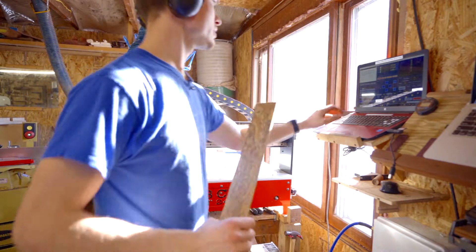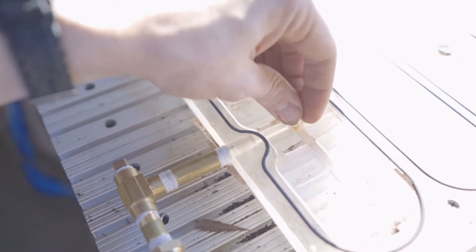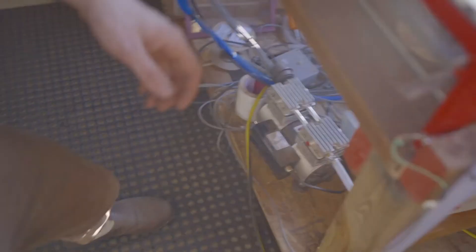I have the board cut, so I'm going to move this machine out of the way. Up here is the vacuum table — you can see this pipe coming in, that's where the vacuum gets pulled. We have this plug here that stops the vacuum from sucking up at the top. We'll put those in every single one except for the board we're running, which is this one right here. We're just going to put this seal over the top to seal it all off. Now the vacuum is only going to be pulling on this board. This is the little pump that draws the vacuum. When I flick this on, this board is not coming up — it's on there super tight, holds everything down flat, and it works really well.